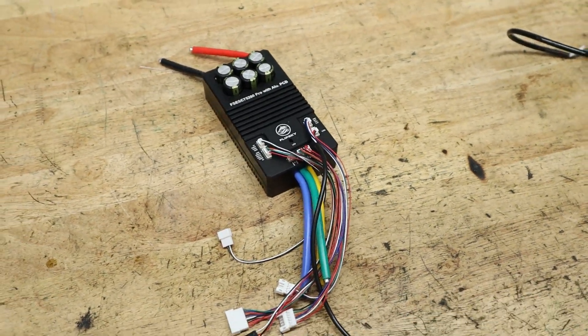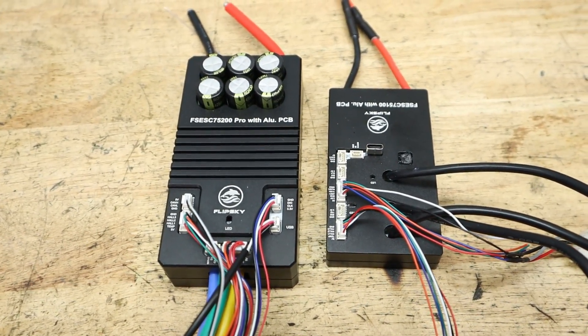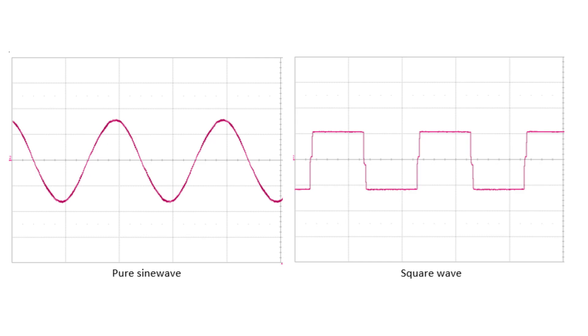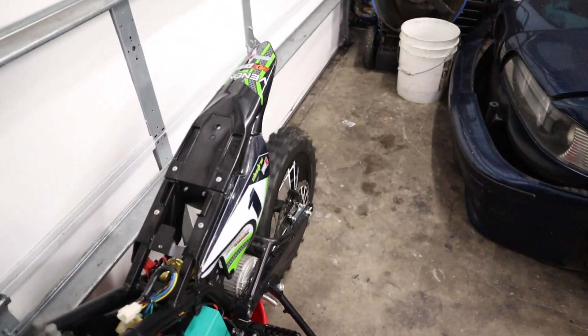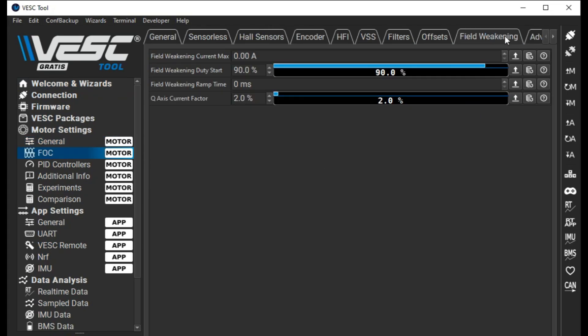This controller not only emulates the square wave style of power that a standard DC controller uses, but it also has a FOC style of output — that stands for Field Oriented Control. Basically, it smooths out the power going to the motor and uses a sine wave of power output rather than a trapezoidal waveform. With this style of control you do end up getting more torque and more efficiency at the sacrifice of top speed. But that can be rectified by using field weakening in the VESC firmware — a special function which supplies power backwards through the phase wires of the motor, decreasing the flux field created by the magnets spinning at high speed.